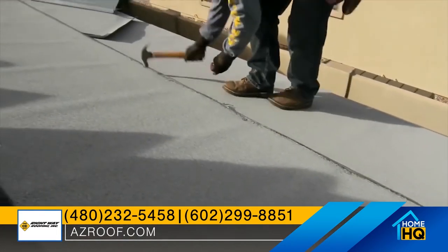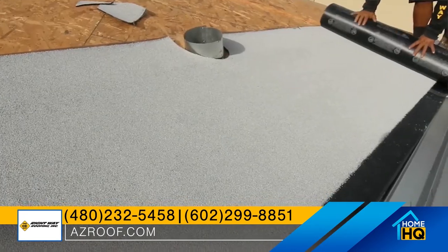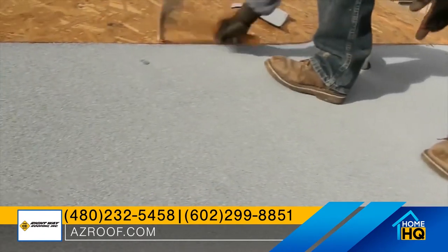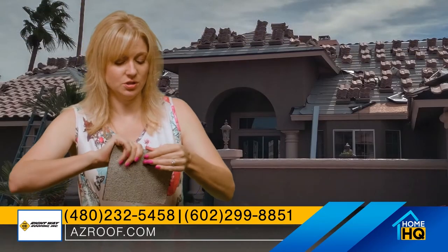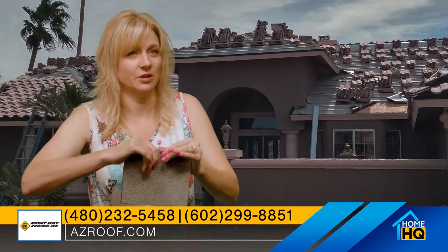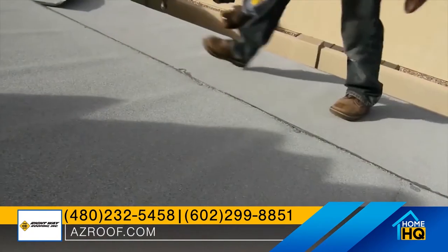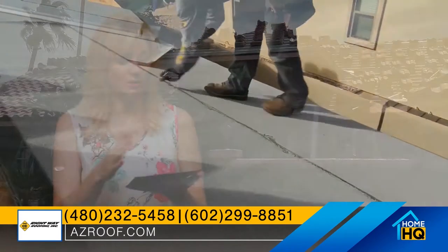What we use is actually made for a flat roof all by itself. It's a very thick modified granulated rubberized system that we use as underlayment — there is no ripping this stuff, you're not going to be able to tear it. The reason we use this underlayment is because my husband found a way that we could offer a 30-year warranty and make a tile roof underlayment system a lifetime roof system.